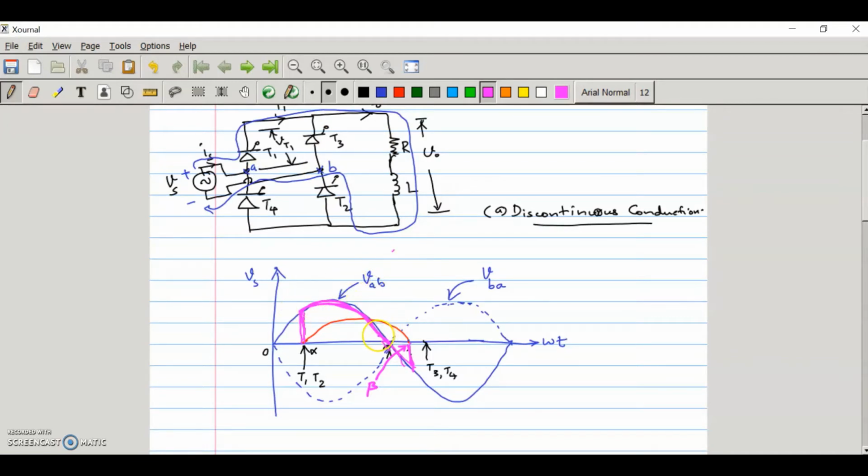So what happens is the energy stored in this inductor is being fed back. I can explain it in some other way. If this is your current graph, this pink color was V0, and with the red line it shows the current graph I0. Now, if this current is I0, then I0 into R will be the voltage across the resistor, VR, which is equal to I0 into R.